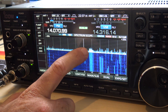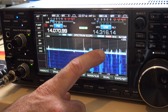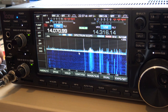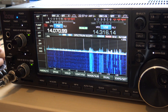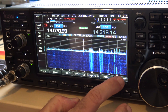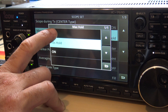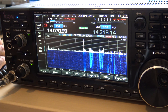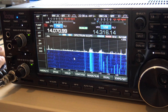I want you to look at the scope. Notice you have a max hold in the background — any signal peak for the next 10 seconds is going to remain as a peak on that waterfall. I think that gets really cluttered. I want to see what happens on this waterfall in real time. These little spikes — I don't want to see a spike that was there eight seconds ago. So we'll go into the settings, hold this, and the first thing I'll do is turn max hold off. Notice the little 10-second hold peaks are now gone — what you see are only signals there right now. No 10-second hold on history. Kind of cleans it up.